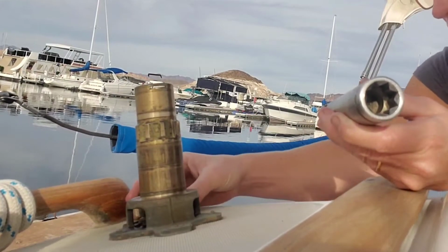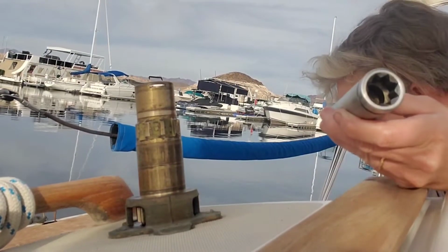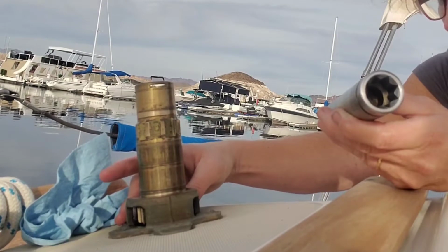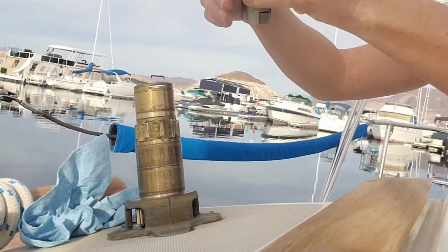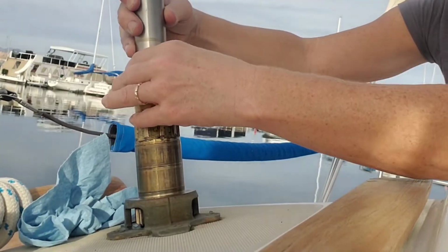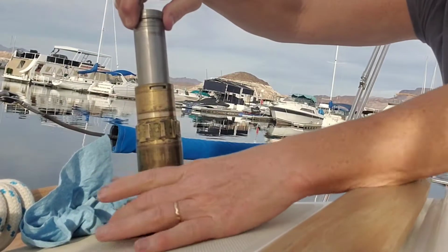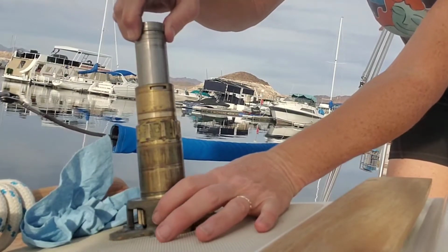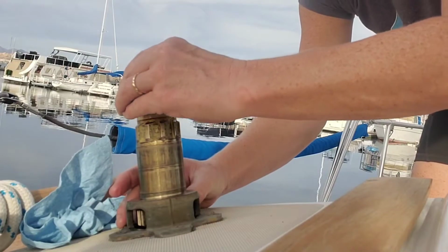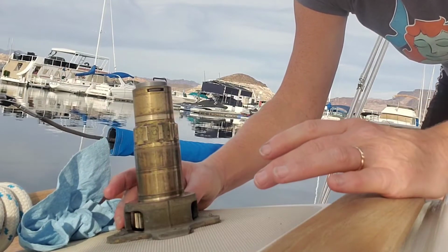All right, well, you had it all in the right order on your towel, and you have your schematic, so you don't have to panic. So in this part, I'm assembling the shaft first, so I can get this gear in place. As you put it in, you want to rotate it in the direction of the pawls.